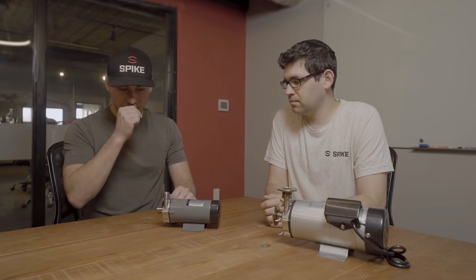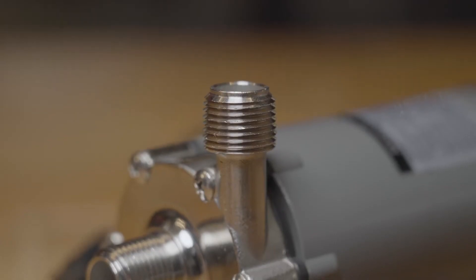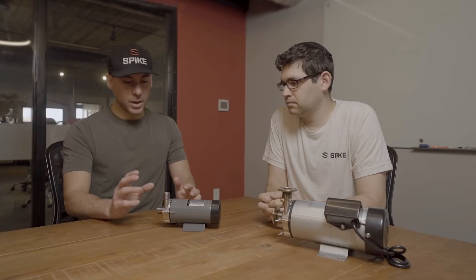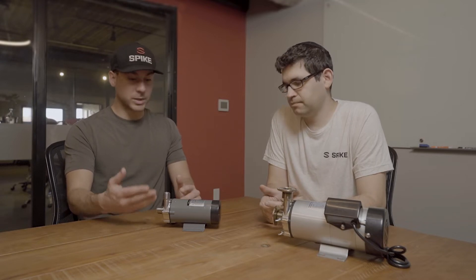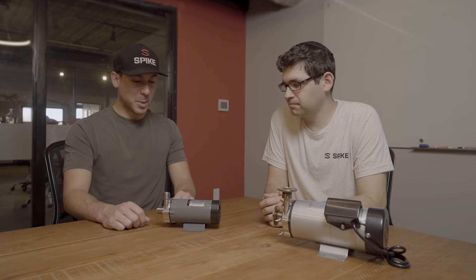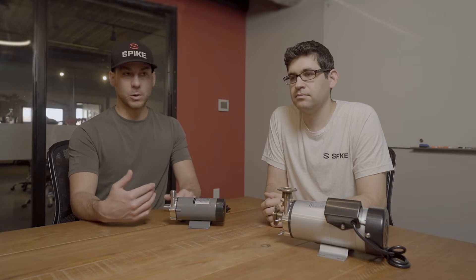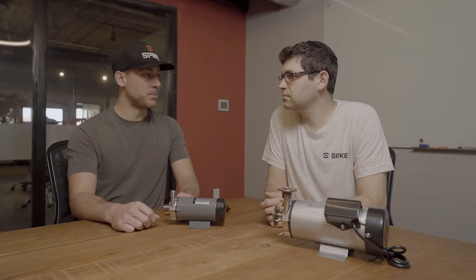First, let's talk about the cheapo option. What I like best is it has half-inch NPT fittings — standard fittings that'll connect to pretty much anything in your brewery. It's also the cheapest at 80 bucks, half the price of everything else. If you just need to move liquid from one place to the next cheaply, this is your option. It also has inline flow as opposed to side-to-side, which is the most efficient way — you're gonna get the most out of your motor. And it has a built-in thrust washer, so it doesn't have a loose washer that'll roll off your workbench and render your pump useless.